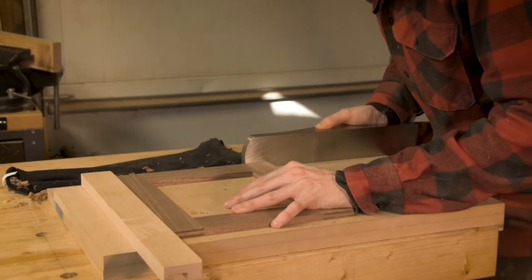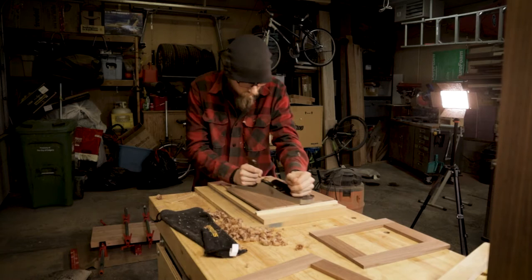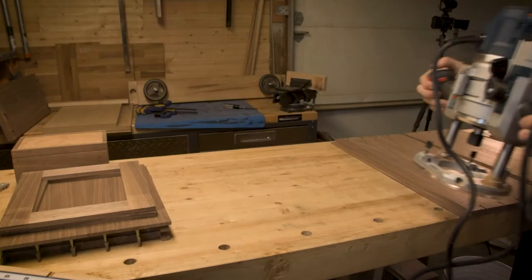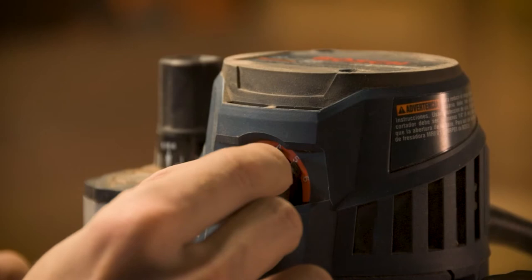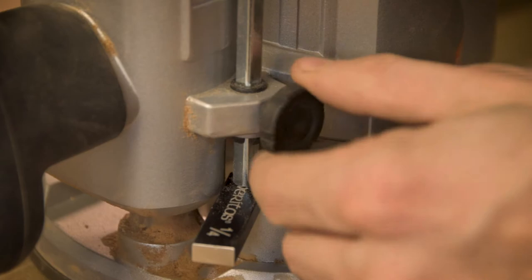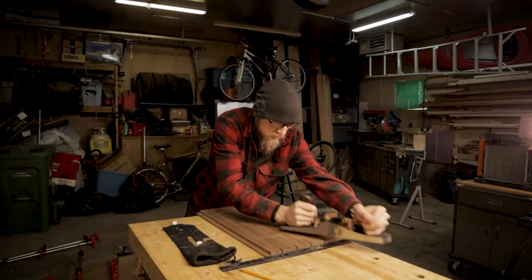Cleaning it up with the hand plane gives you a perfect fit inside of the cabinet. Same thing on the top shelf - I just went and smoothed it all down with my hand plane. As much as possible I like to try and finish all of my stuff with the hand plane; I think that it just gives the best possible result. Then to cut the grooves that these shelves are going to sit in, I used my router and a little dado jig. Because I don't want these dadoes to go all the way through to the front edge, I needed to make sure they were stopped. Using this jig I just cut a nice simple quarter-inch dado across the panel, and then I could go in and start to finish everything up with the hand plane and prepare it for finish.